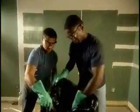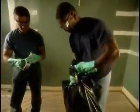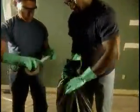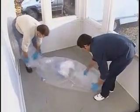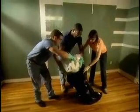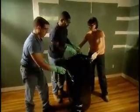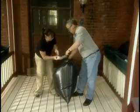First, pick up any big pieces of debris. Put them in a heavy-duty plastic bag and seal the bag with duct tape. Next, fold the plastic sheeting with the dirty side inward and place it in another heavy-duty bag. As before, seal the bag with duct tape and store it in a safe, secure location away from your family, your neighbors, and your tenants.